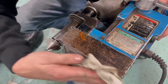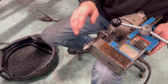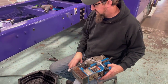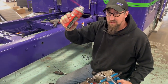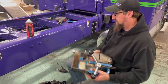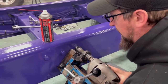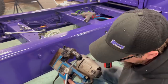That's what the professionals use, so figured get something. So once I put this up there, it's a mag drill. I'll flip this switch and it'll stick hopefully to that. We just drill the hole far enough. We got to use plenty of some sort of cutting oil, lubricant, anything. So, here we go. Get it close, lined up where you think it's going to be. Flip your switch. It just stuck to it. So, we're going to turn it on.